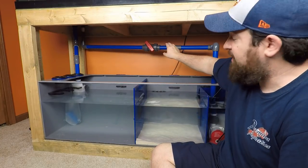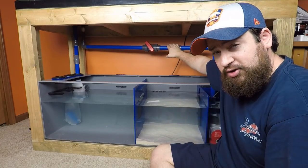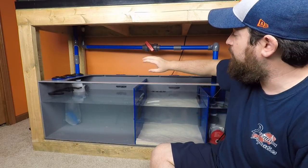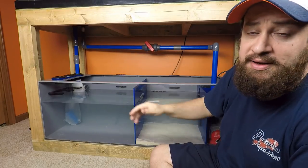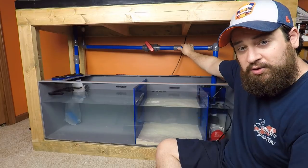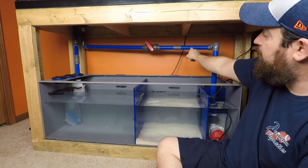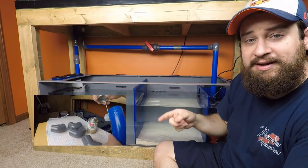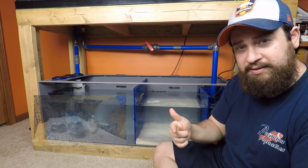I went ahead and got eShop's blue plumbing kit — it's one inch. I'll put a link in the description below of everything I'm using so you can check it out. I couldn't find gray schedule 40 PVC, so I just bought white and spray painted it. I sanded each piece to make sure the paint would adhere really well, then did a couple of coats of gray. For gluing, I did a light sanding on each end, put some glue around the PVC and the fitting, put them together and did a little twist to make sure I got glue all around that seal.